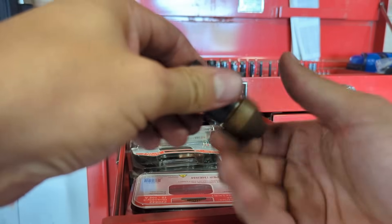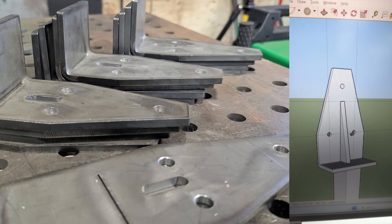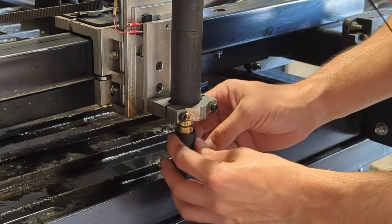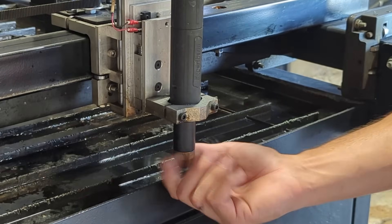This design included a simplification of the three-piece weldment. I turned that 90-degree flange into one bent flange. They probably did it this way because they didn't have a press brake, and neither do I — but that's the whole reason we came to this video, so more on that in a bit.